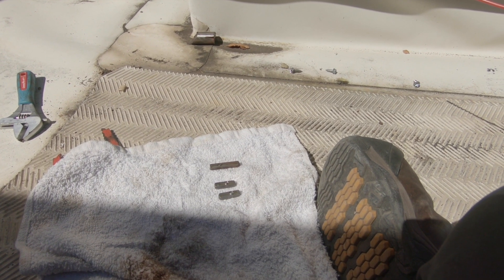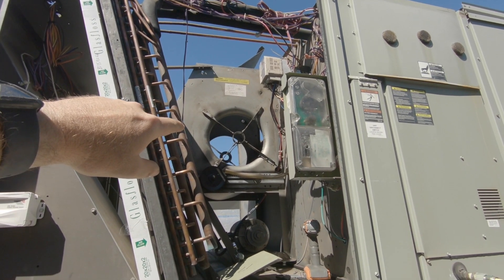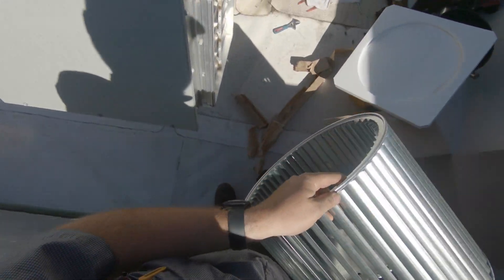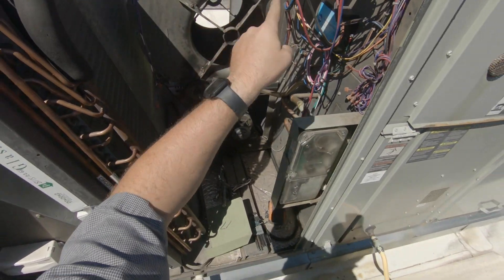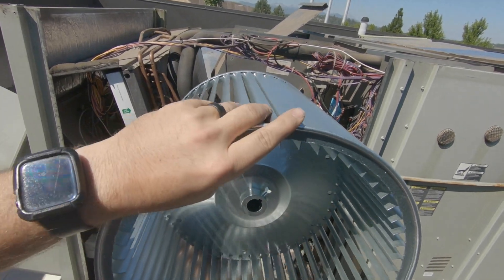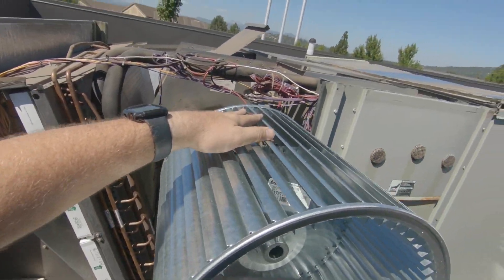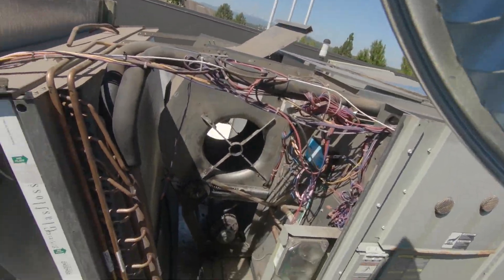We're gonna go ahead and start assembling the unit. First things first, we're gonna put the wheel in place, then the bearings and shaft, then tighten everything down. This is what the new wheel looks like. It's very important that we put the wheel in the right way, otherwise we'll be doing this twice. We look at the rotation arrow — it spins this way. Looking at the wheel, we see the scoops — they need to spin that way to blow air, so the wheel goes in this way. If we go the wrong way, it won't push any air.